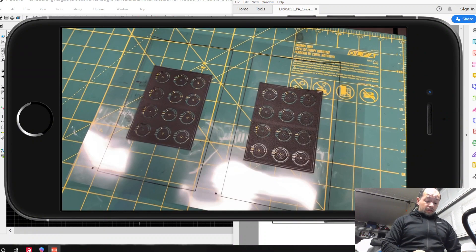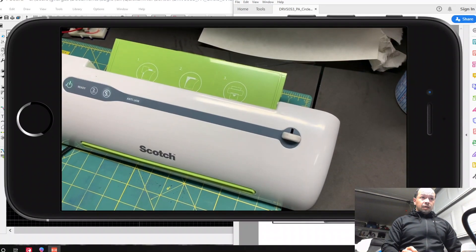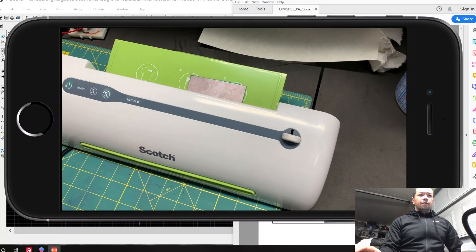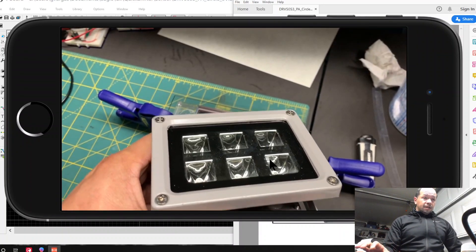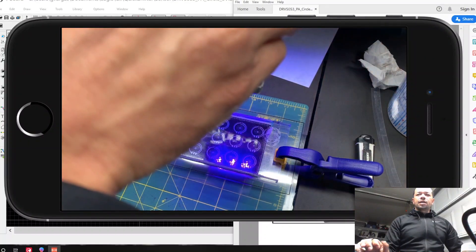Once you have it like that, you can get a piece of PCB board and add a photo sensor film to it. You can either use a heat gun or a laminator, running it through a few times to make sure that everything is nice and even. Once you have that, put your print on top of the board and expose it to UV light.